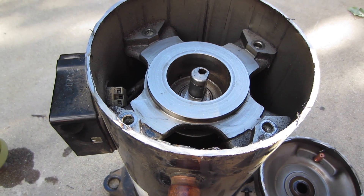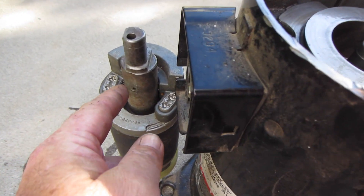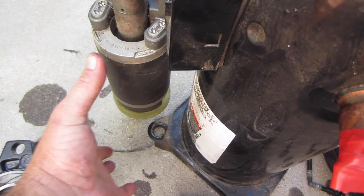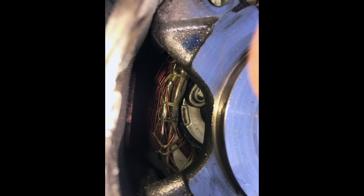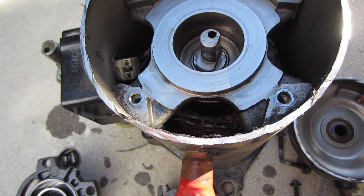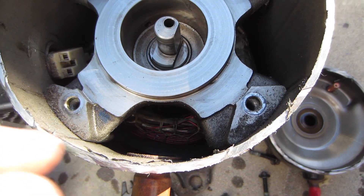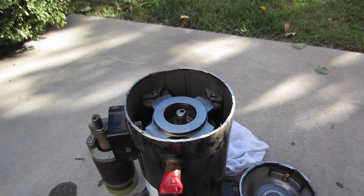We're talking a lot of years here. But here's the rotor — what happens when the bearing goes bad, the top one, the bottom one, or the one in the scroll: that rotor is going to tilt. Once the rotor tilts, it's going to hit the stator. And once they touch, it's going to shave it like a snow cone — shave the rotor or stator where they hit. The sparks are going to fly, and then the metal shavings will hit the windings and spot-burn through the varnish of the windings.